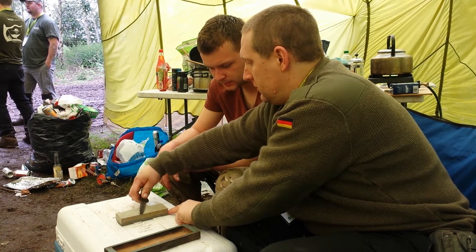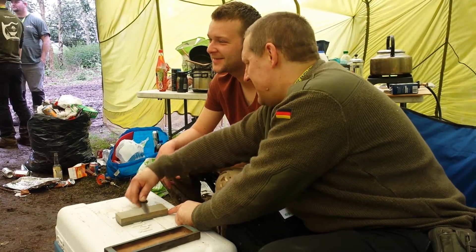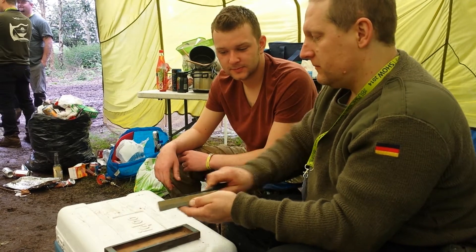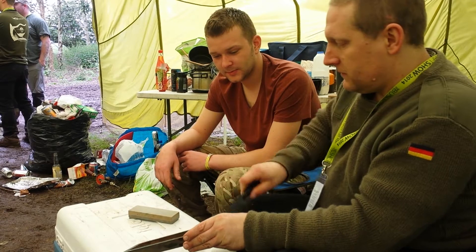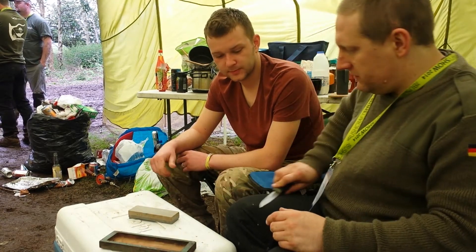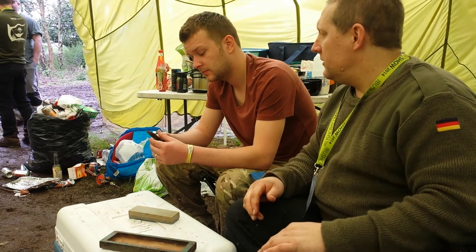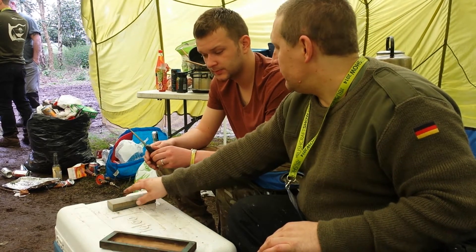And then the other way — I'm taking it like a sushi chef. I'm creating a burr that way, now the burr off — no, I'm making a burr the other way. So you literally now could go to a piece of wood — not hard — I'm not trying to grind a new edge. Now you could get a newspaper, you just want to snap the burr off. Now that is a reasonable edge — bend it backwards and forwards until it comes along. That's the practice; there will be more to it than that, but that's the practice.